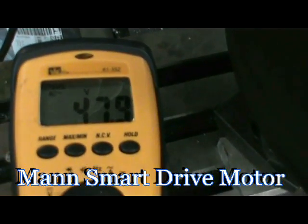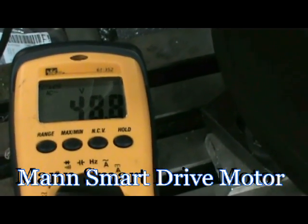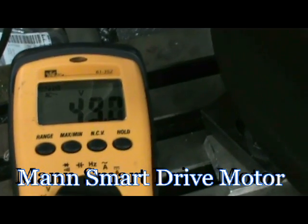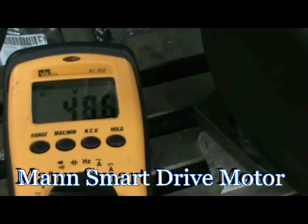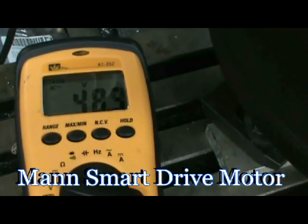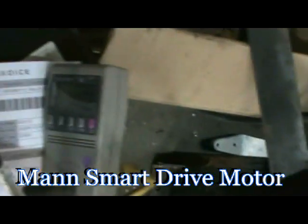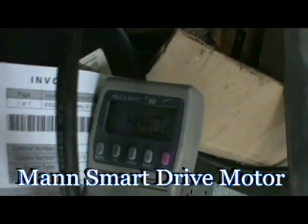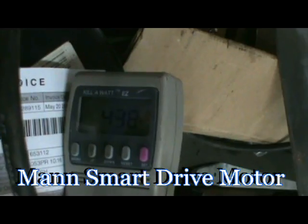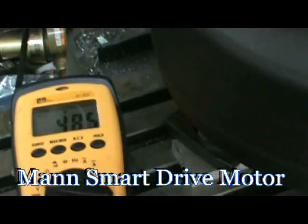At 200 RPM, we're producing 48 to 49 volts — that's with a three-wire phase system. And it takes 442 watts to run it. That's not bad. It doesn't take much more to spin her up, and she's doubling her power at just about every RPM change.